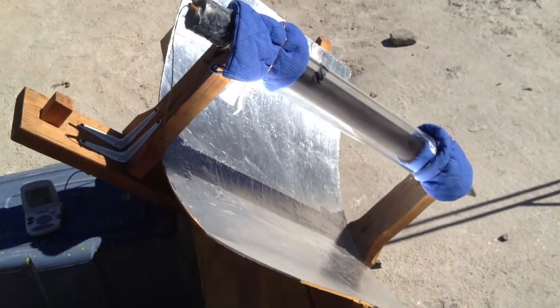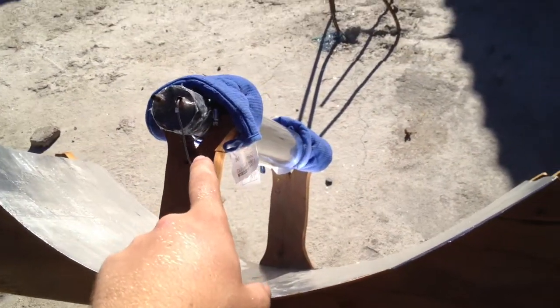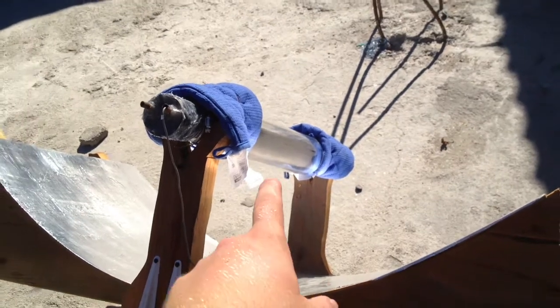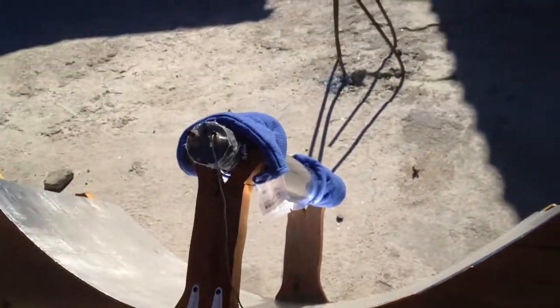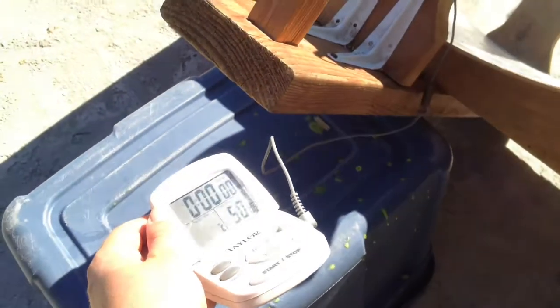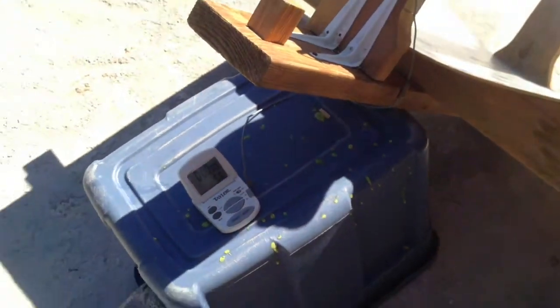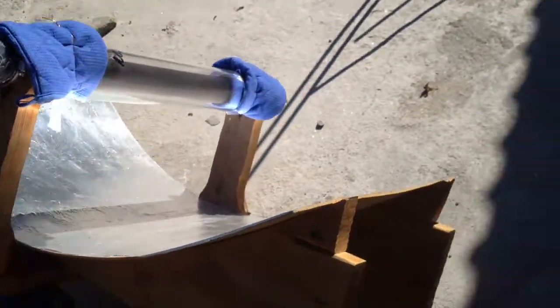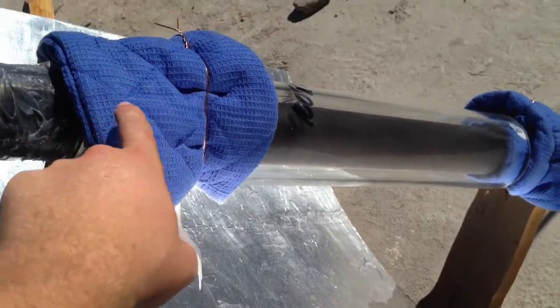This kind of test really shows me that the solar car is possible. I'm going to use a similar size tube, also a similar glass insulation pipe with stale air, maybe a vacuum. This curve is going to be almost twice as big — this is only three and a half feet, and I'm probably going to use six feet, so that's more energy. Right now this oil is at 192 degrees. I'm only probably going to operate between 150 and 200 degrees. The sunlight is only coming into this small 16-inch section — I had to insulate it here.